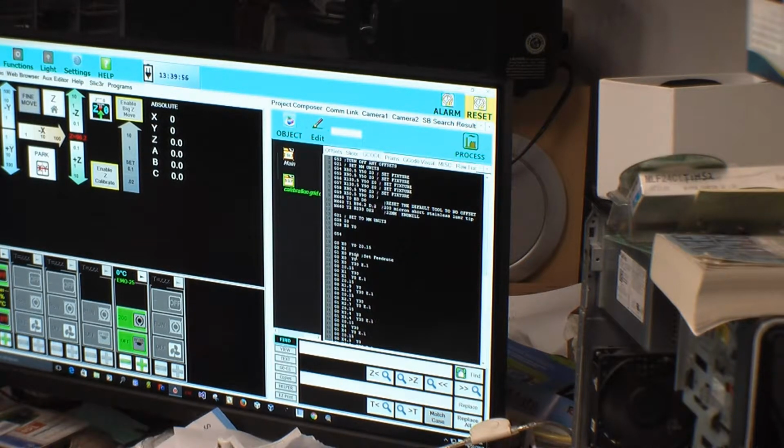Alright, so right now I have a G0, X0, Y0 and a Z of 0.15. That's got to be negative because it's going to be above the bed right now. So I'm actually going to give myself another one here. Let's see if I have a Z going down. Yeah, there's your Z right there.